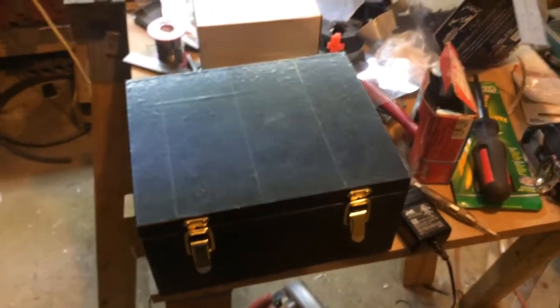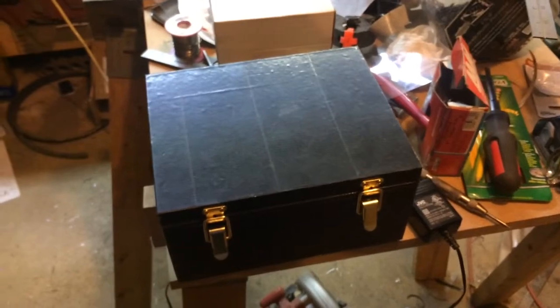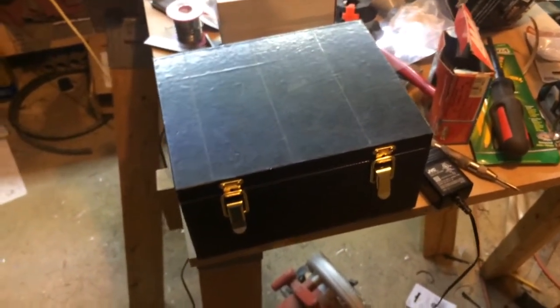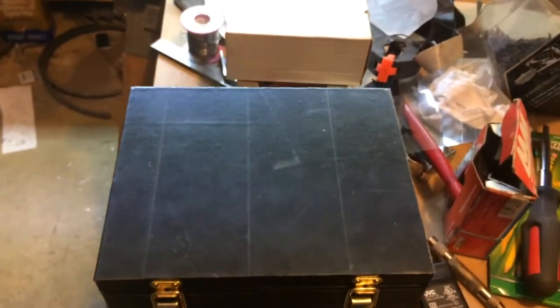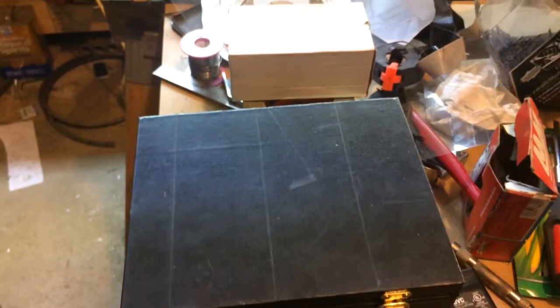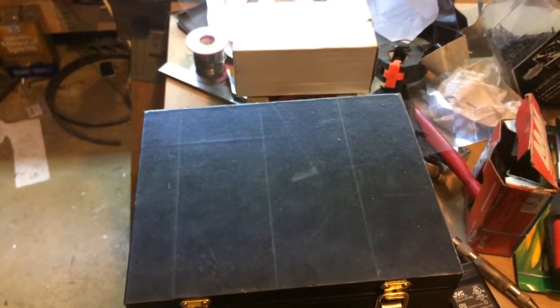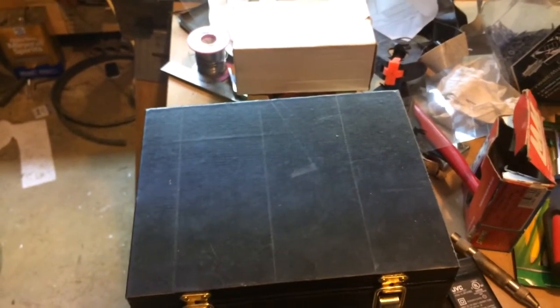So it's a little bit of a different material, different application, and unfortunately isn't going to work like I hoped it might, the way that I like to etch stencils. Now, I suppose I could develop them and then laminate them or heat them onto a piece of steel and then use acid or electro etching to do that. But then you've got to strip the thing off and clean everything up.